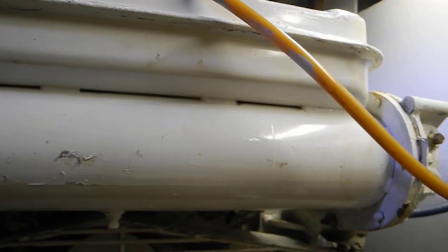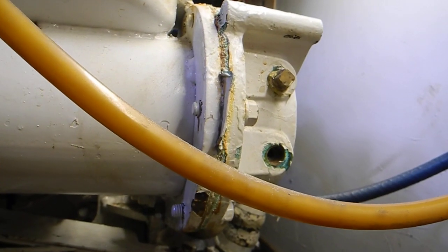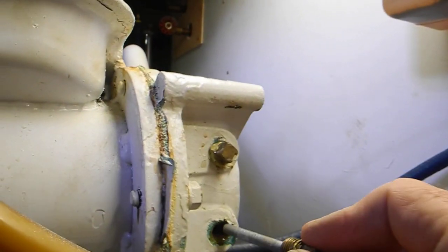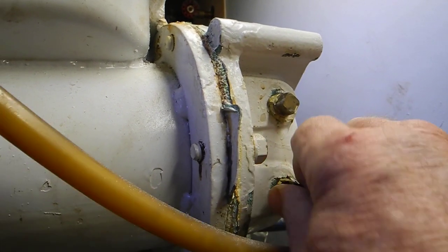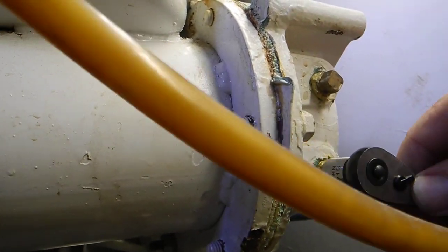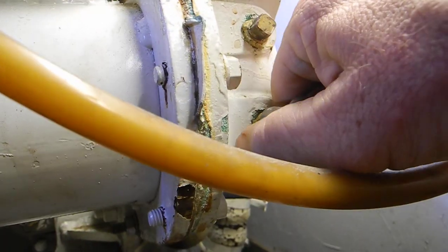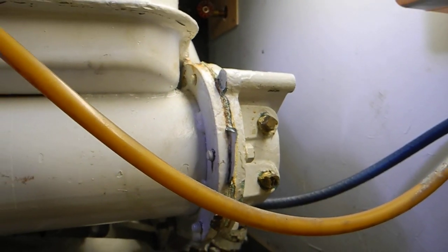Let me go ahead and put this little pencil zinc back into the left side of the Caterpillar heat exchanger, and then we'll take that big one out. Right here you can see we're still dribbling a little bit of water coming out of it. I'll put this piece in — using my wrench to give it a little oomph, flip it in the right direction. Okay, so those two are safe and sound. Let's go ahead and start on the next one.